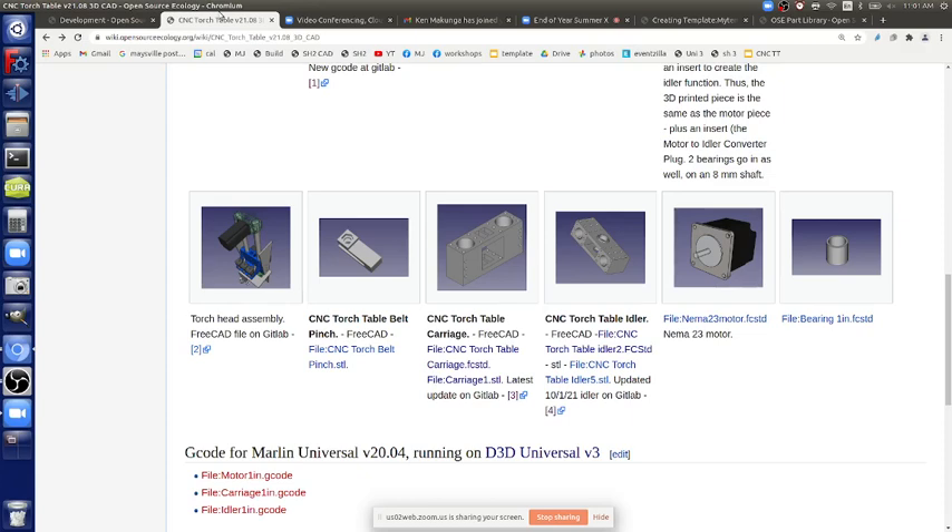They're high pressure — 2,000 PSI — which means that if it falls over and the top gets knocked off, it becomes a torpedo. Literally. If that happened in the middle of a stadium, the thing would fly over the stadium. It's very energetic. The amount of pressure and force stored when you have gas at 2,000 PSI — it's like 150 atmospheres — really, really powerful.